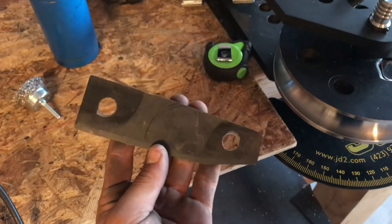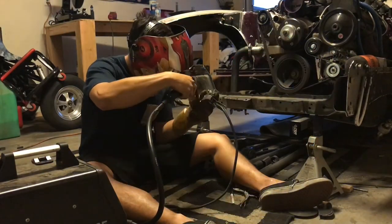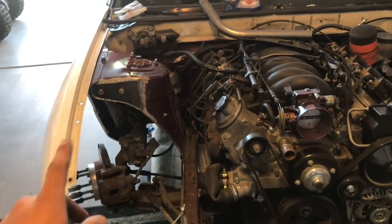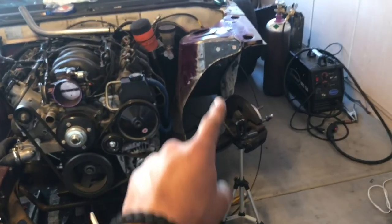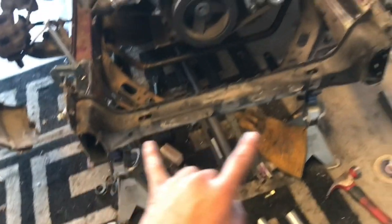I got both of my center punches, drilled out my pilot holes, then drilled out my half inch holes. Now I'm going to repeat this process with the four plates, bolt them up, and prep them for welding. As of yesterday we had that finish and the bar coming down. Today I went ahead and welded this in place — that's how that came out. I duplicated the exact same bar for the other side, drilled the holes out, and these are ready to be welded.